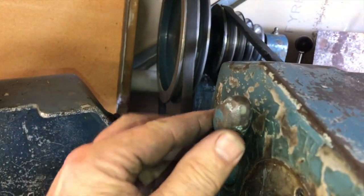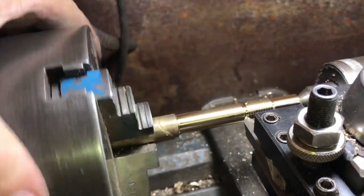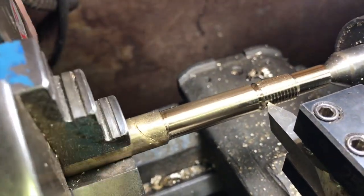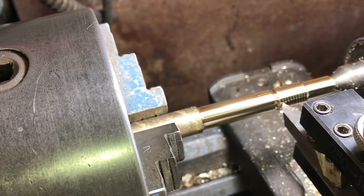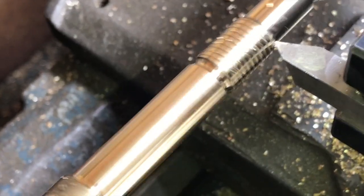I forgot to mention we're running in back gear so it runs at quite low RPM. I'm disengaging back gear, putting it in neutral, and turning the chuck backwards to wind the lead screw back to the starting point. We shouldn't really have to do this with the correct setup — the carriage has a dial to tell you its position — but because this machine has been converted from English to metric, that didn't work. Since the motor doesn't go in reverse, it had to be done by hand, which is why I wanted to rewire it to run in reverse later.